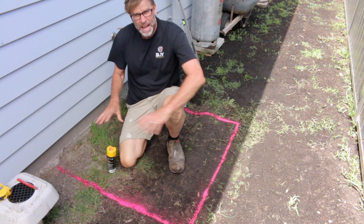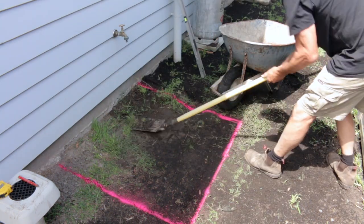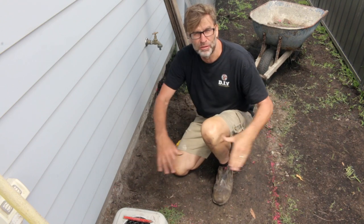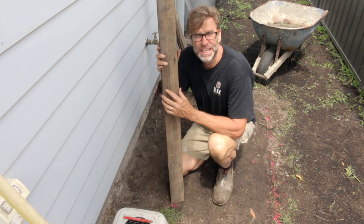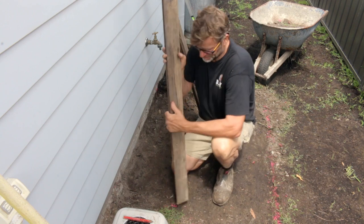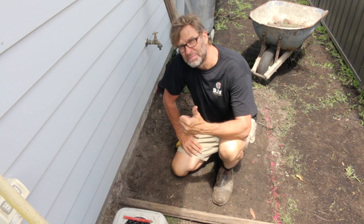All I've done here is marked out where the concrete slab's going to go. Now we need to dig this out, just scrape the top off it and get a nice firm surface. That's a good solid surface to work off. The next job is to form up for the slab. For the boxing, all I'm using are these old recycled floorboards I had lying around the house. It's a bit of a shame because I had a really nice project lined up for them — oh well, the sacrifices I make. Form up for the slab, install the plumbing, and then we're good to lay the slab. Too easy.